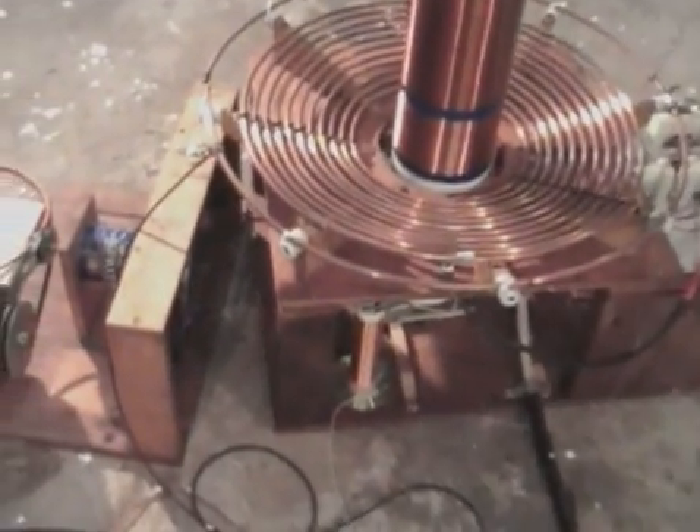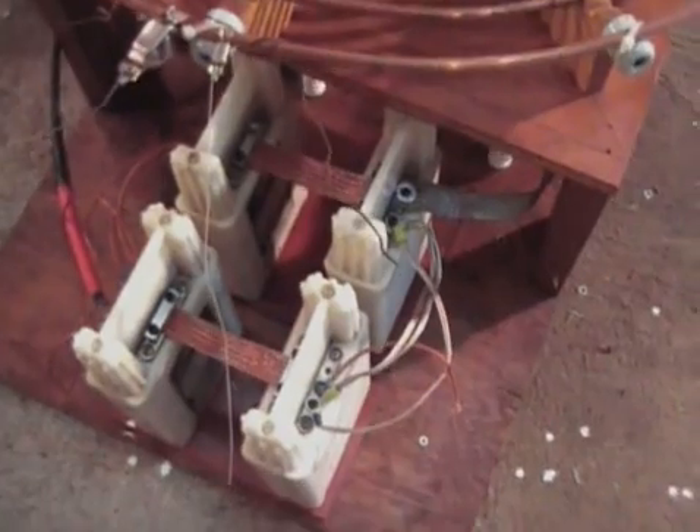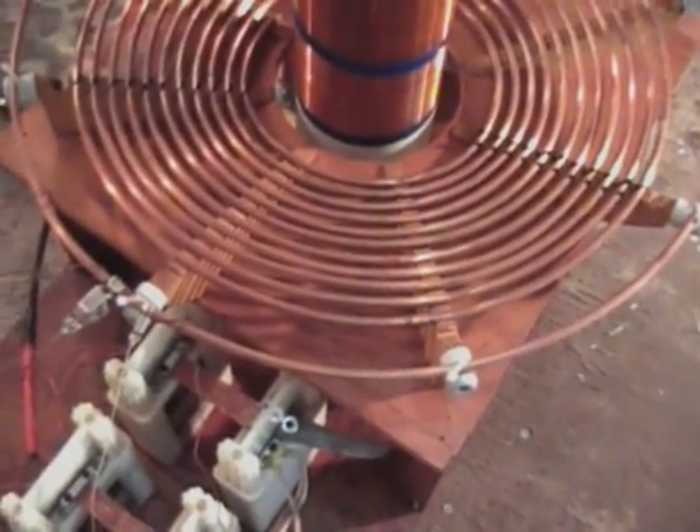From here all that goes into the Tesla coil. I have the rotary spark gap pulled away so you can see the rotary spark gap wheel. It's a phenolic disc with electrodes along the outside that make contact with stationary electrodes. There's a motor for the spark gap. There are the primary capacitors in a series-parallel arrangement — it gives me .04 microfarads. Three-eighths copper tubing for the primary, tapped at 10 turns.